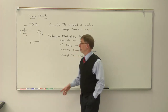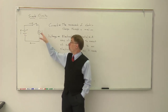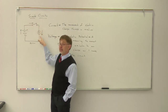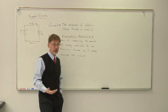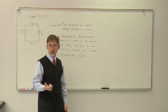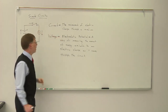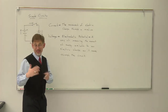What we're actually using up here is energy. We know the light bulb gives off light when we complete the circuit, and light is a form of energy. So the light bulb isn't using up current — it's using up energy. The battery gives an electric charge energy, and then the light bulb uses that energy up. Specifically, it converts the electrostatic potential energy the battery gives the charge into light energy and heat in an incandescent bulb. So we're still conserving energy; the system loses energy and it gets converted into energy that's thrown out.